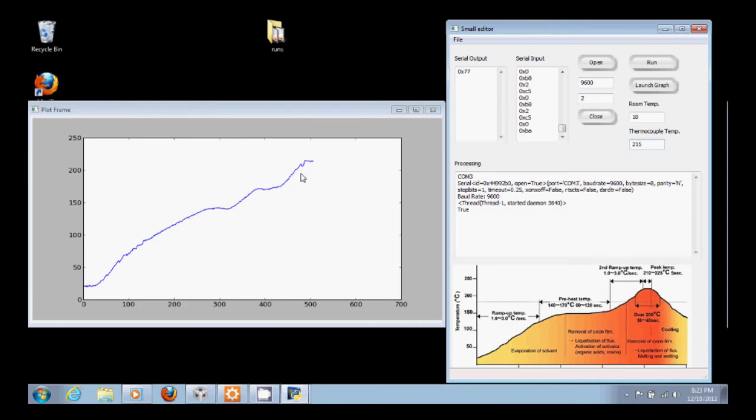And so over here, you can see we're trying to hold it about 215, and it's holding at about 216, 217. There's a little more ripple up here just because it's so much more power to control. We overshoot a little bit by about 5 degrees C. We're hitting 220. But again, for my application, that's okay.